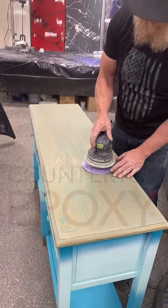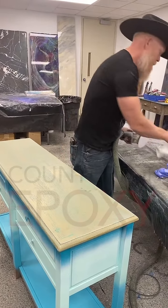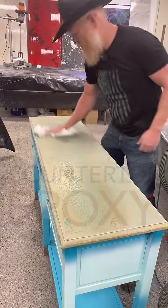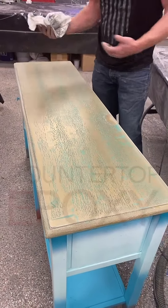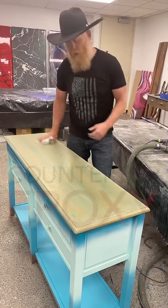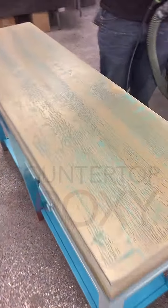Holy cow, like the true metal and the epoxy countertops. I can say, especially on warranties, because I had to run a lot of warranties as a countertop shop when I did granite. And I got to see the average warranties. And we had done Staron and Corian and some other stuff too. I could not believe when I went to a really high grade countertop epoxy how many warranty issues were fixed that I ended up not coming back for. I never saw cracking. I didn't see near as much scratching as I was worried about. Now you will with a cheap epoxy or a misinstalled or just an abused epoxy, but you see that with anything. This applies to casting as well.